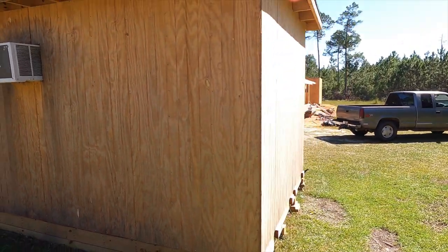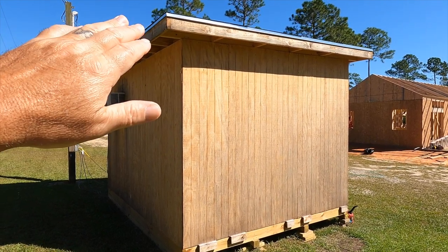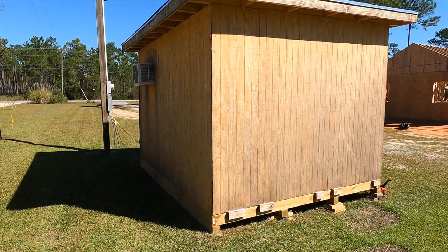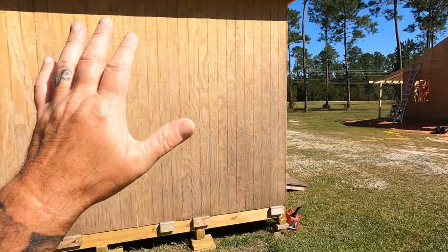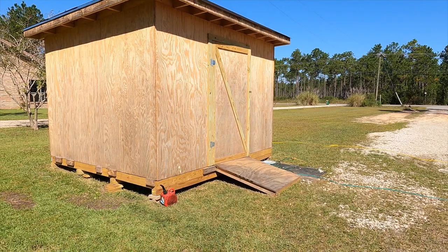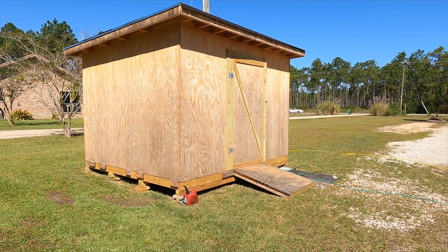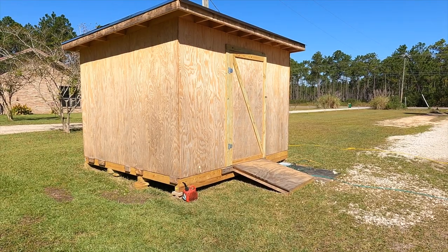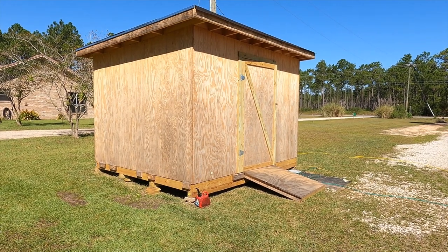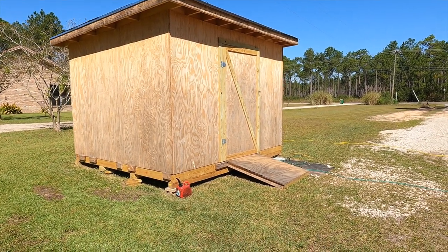I still need to finish the fascia, clean up the outside, paint or stain it to protect it, and do my soffits. All of that roof structure is two-by-six. I did two-by-four walls on 16-inch centers and a two-by-six roof — just a flat roof that drops about eight inches across that 10-to-12-foot span. Plenty of runoff. It has a flat rolled roof with a self-adhering back. It's stuck down good — no roof leaks, no issues, no problems.